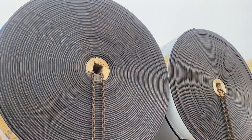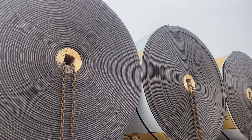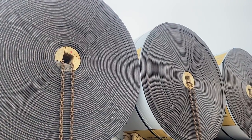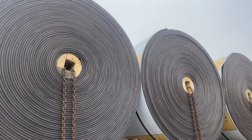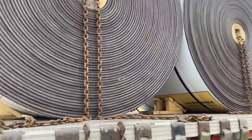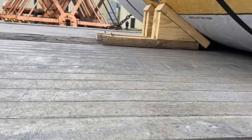What I can do is show you how you need to secure it. First thing is I've got three rolls — between them they're about 37,000 pounds, so that's roughly around 12,000 pounds per roll. I've got two chains ran through the center on each roll, and on the front I've got two sets of blocking.